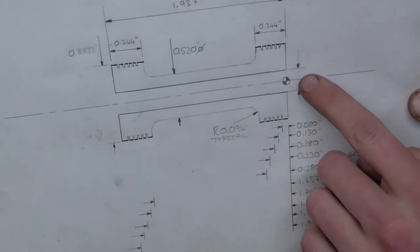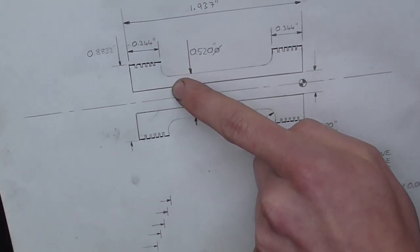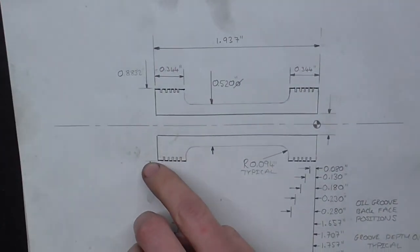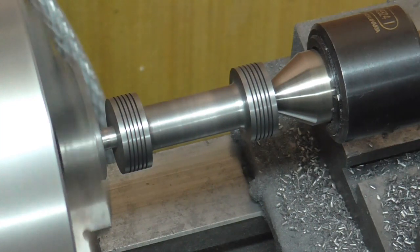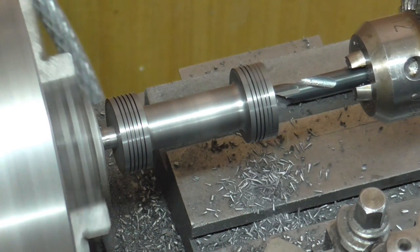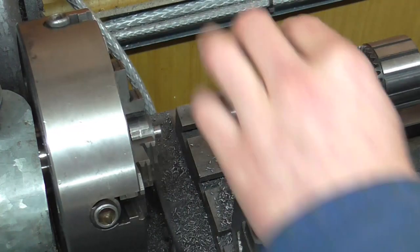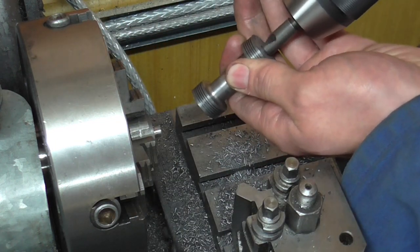Now for my cunning plan. I started by drilling and the drill bit has got to roughly where my finger is, so it's still not a fully formed bore. What I'm going to do now before I finish the bore is take this grooving tool that I've ground up and work on the back face. So I'm going to finish the back face of this bobbin now, and that leaves the component rough down at the chuck end. What I'm going to do now is complete the drilling of the bore and in doing so I will separate the piece from the stock material. There you are — as you see, the bobbin comes away from the stock material and that leaves me a bobbin that has been finished in one setup. A quick manual deburr of the rear chamfer and that's that.